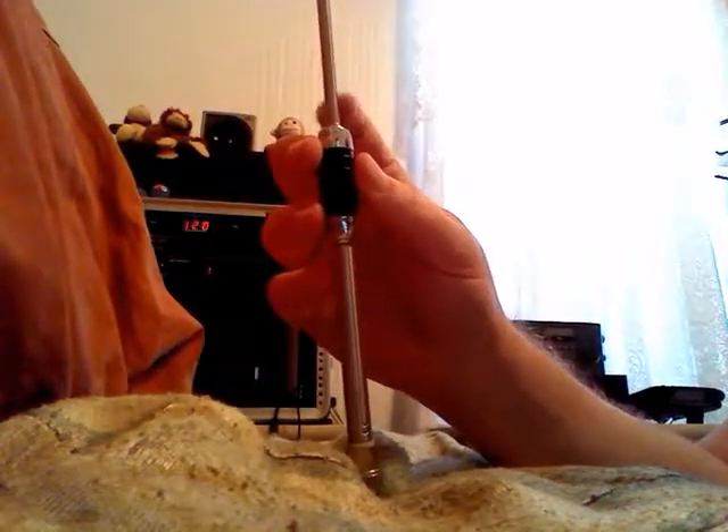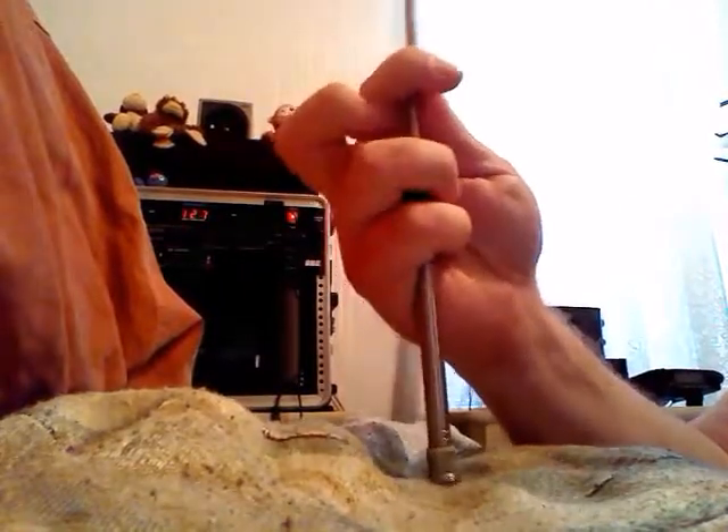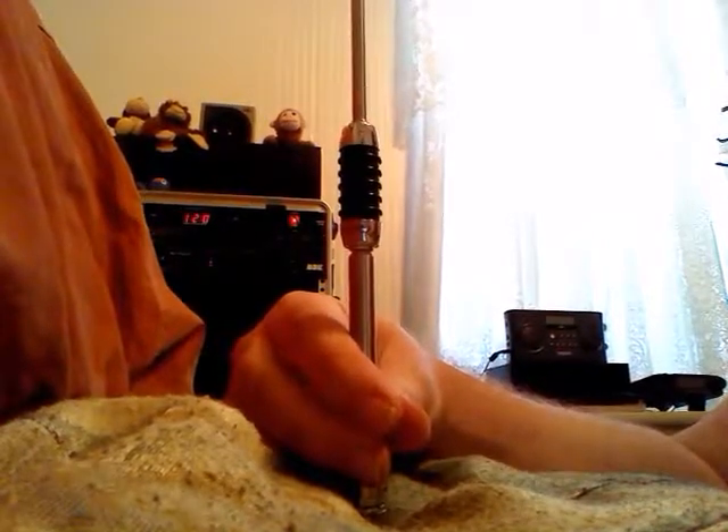You can feel it shaking a little bit in there. Also remember that sometimes it works better by shorting the coil down — you just take the fat section of the top piece and push it down about a quarter of an inch. You'll feel it kind of just grab a little bit, and that bypasses the coil. They don't really explain that in the manual, but check that out and you might find the best result. Highly recommended — every scanner should have one. I'd recommend these just for the portability, but again the weak point is the length and the structural integrity — it's kind of weak at the bottom there; you don't want to snap that. Alright, peace. Give us a thumbs up, please subscribe. We'll be doing some more reviews on another antenna from Radio Shack. 73. Peace.